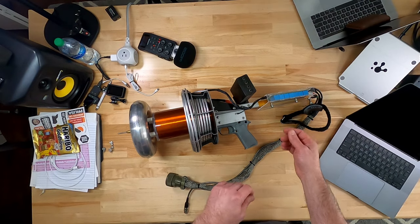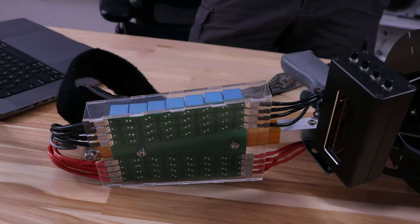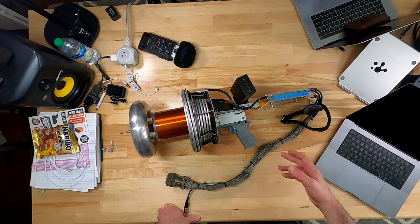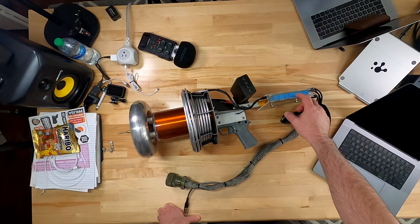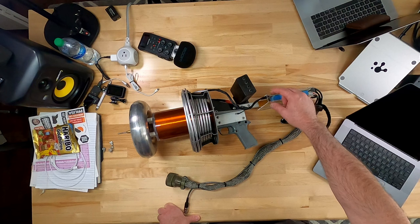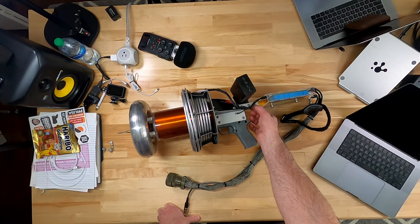There are eight total MMCs. I don't recall the exact capacitance—I built this in 2016—but I'd guess it's in the 0.05 microfarad range, probably not as much as 0.1. Phillip actually designed and built this box. It's acrylic, interlocks together and is glued, mounted on a one-inch square aluminum tube.